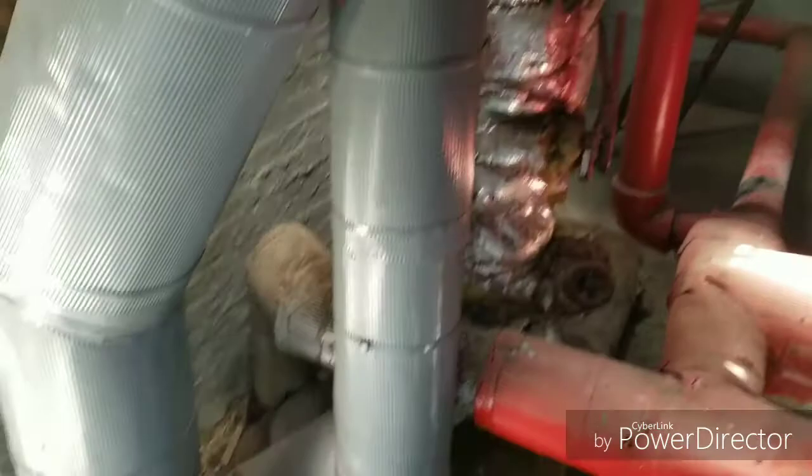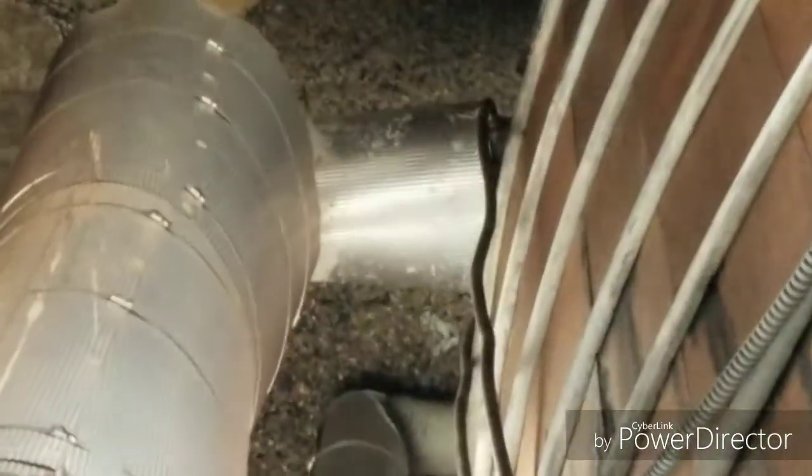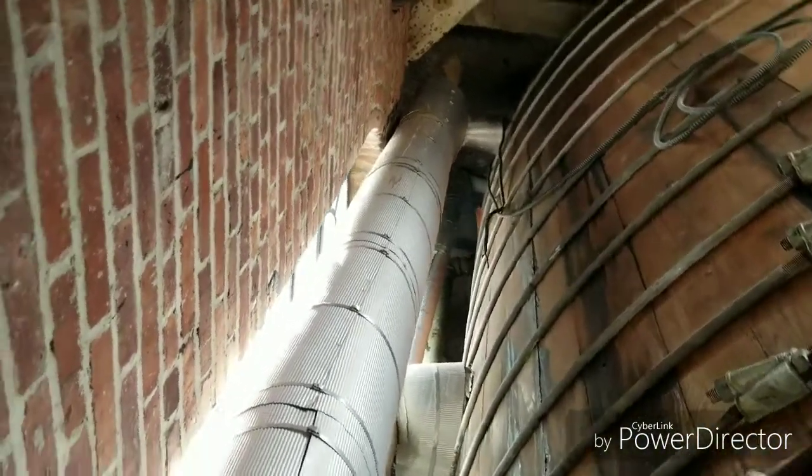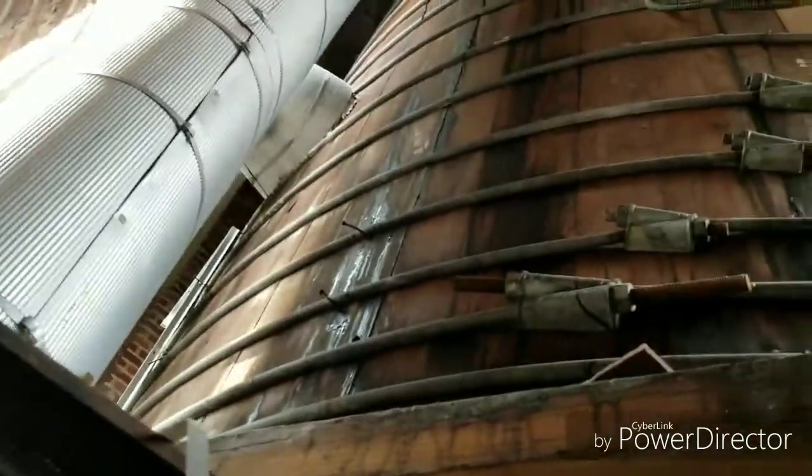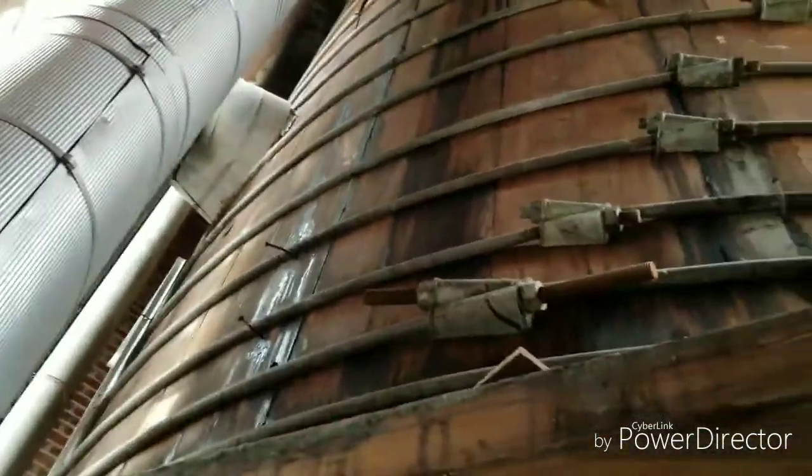Now I'm up at the roof tank — the water tower — and I'm going to show you the standpipe coming off the bottom. Here are some pipes: the one going down to the building, one that shoots all the way up which is a fill line, and that's an overflow that goes into the standpipe. On the side there's electrical — a wire going down for the floats that turn on the pumps in the basement. This is the standpipe here.